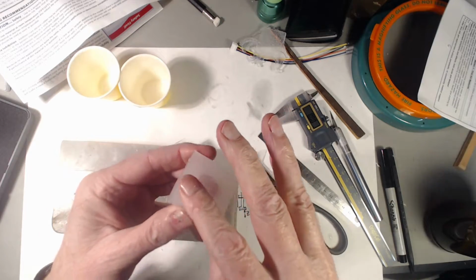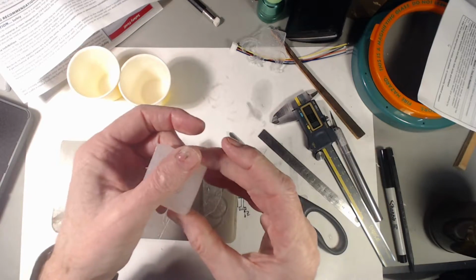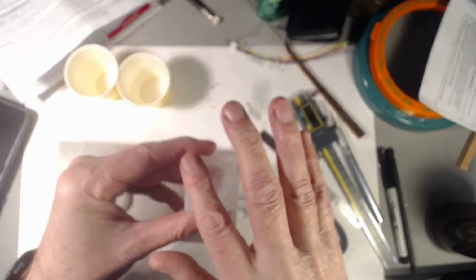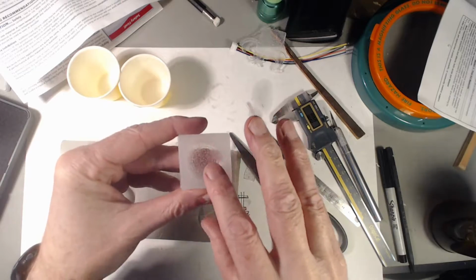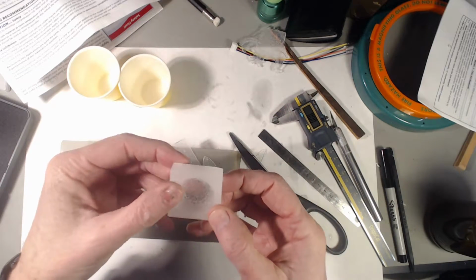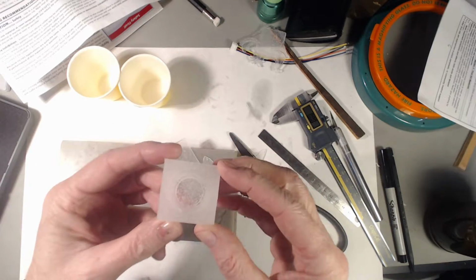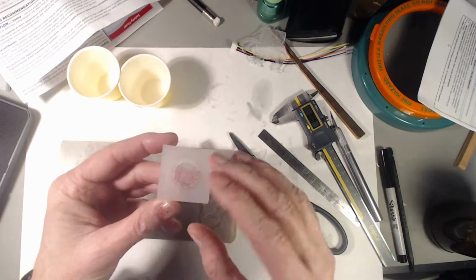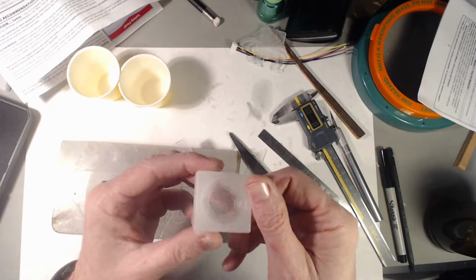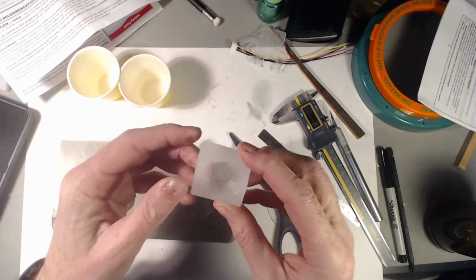You can feel the bubbles on the top because this is the direction of gravity going up. So the bubbles have a tendency to float to the top and break, whereas on the bottom side, the bubbles are biased to the other direction, so you don't feel it. So I guess if you wanted a smooth surface without vacuum degassing, you'd need to do your casting upside down, so the bubbles went to the unfinished side and floated away from the side you wanted to be smooth.